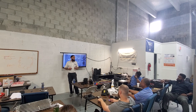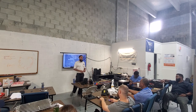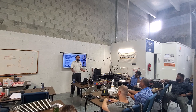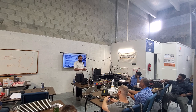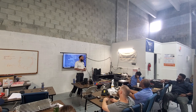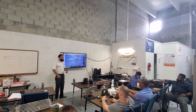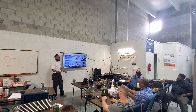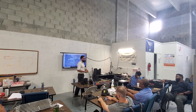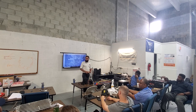Feel confident in your work like I do, because when I first started doing these sealed systems, what I started noticing, these are big numbers you're telling these customers, they want to have confidence that this thing is working. So I had to actually sit there and show them, and they would be like, you sure? But what I did was I swapped the voltmeter and I put the little K-type up in there. And I'd say, hey man, look, you see the temperature now? Okay, I'm gonna turn the unit on. And while I was putting the cover back and pushing the fridge back and picking up my tools, that temperature was dropping. And I was like, look, she's already down 10 degrees. Oh, wonderful! So it provided a way for the customer to actually get eyes on their investment and your good work. Most times you just be telling them, wait about 12 to 24 hours and you'll be cold.